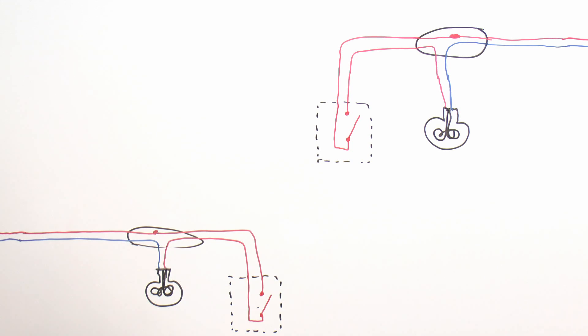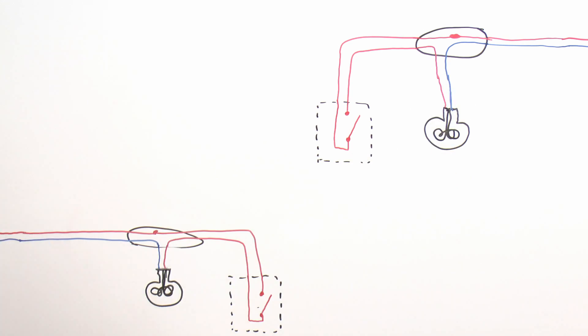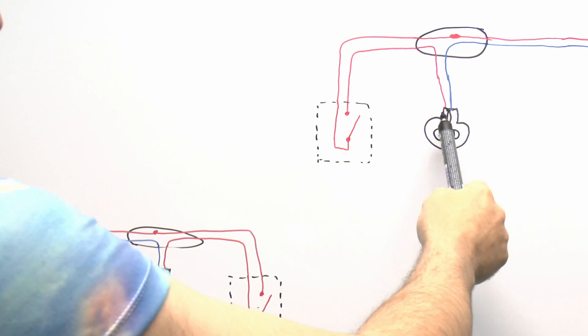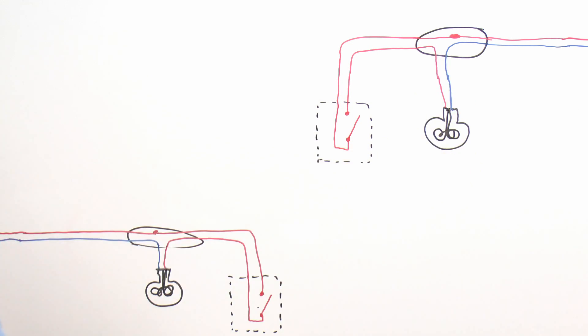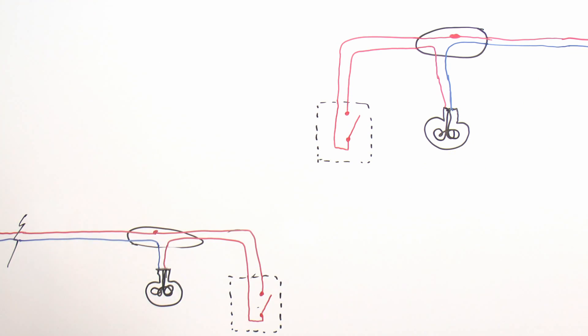What I've drawn here is two separate light fixtures and two switches — this one upstairs and this one downstairs. For both of them we've just got the line and neutral coming in from the fuse box, so the neutral goes straight into the light fixture and into the lamp or light bulb, and the line comes in and then we've got a twin cable going to the switch and returning from the switch back to the lamp. When the switch is on it completes the circuit and switches the light on. These two would go to the same fuse box but on two separate circuits, so you wouldn't normally want any interconnection between them.